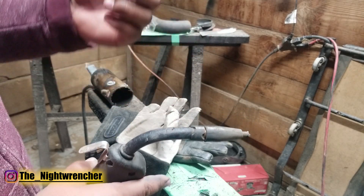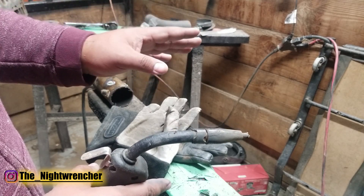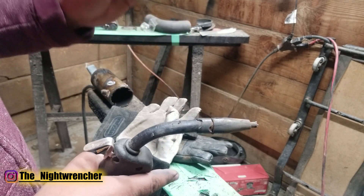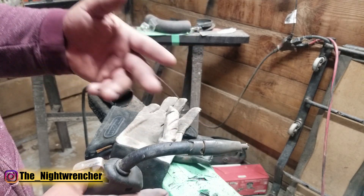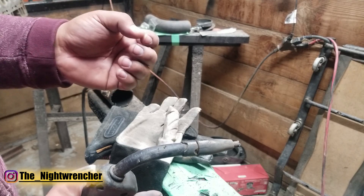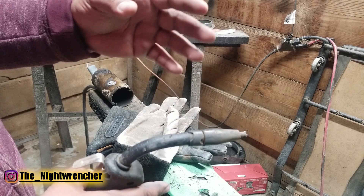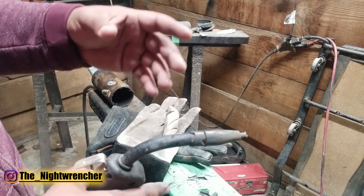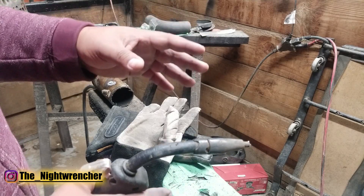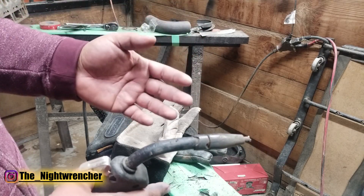You're going to be able to start your welds easier, shape your welds easier, and everything's going to come out really, really nice. One big plus with using a thinner wire is if you're welding sheet metal, exhaust, or very thin metals — because you're using a thinner wire and it takes less heat to get it started, you're going to be putting less heat into the material, allowing the material to retain its shape better. You're going to prevent burning through, and one of the most significant changes I found in my welding was actually switching to that 0.030 wire.